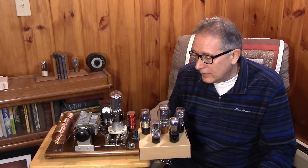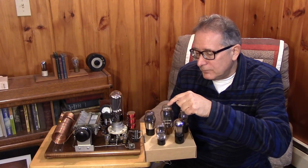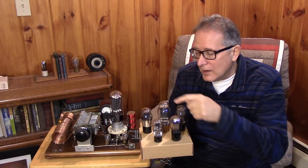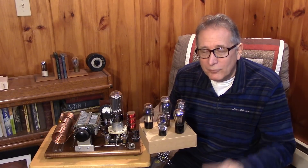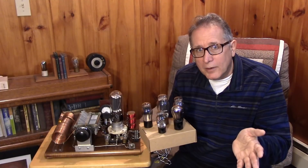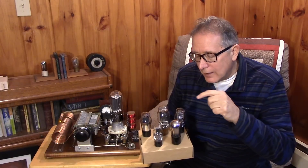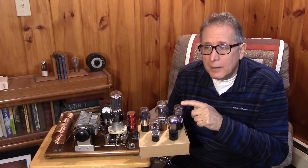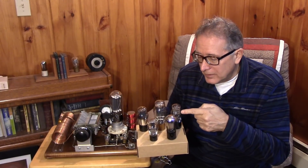With these smaller tubes, you should be able to achieve something between half a watt and probably four or five watts output. The efficiency of an oscillator is generally around 30 to 35 percent. So if you're running this Type 10 triode as an oscillator at 10 watts input, you might get three or four watts out. Getting a single tube to oscillate on 20 meters in a stable fashion is a little bit tough, so a lot of people on 40 and 20 do use master oscillator power amplifiers — MOPAs — perhaps with a Type 27 oscillator driving a Type 45 final. The 45, by the way, is a 1920s tube, very popular in jukeboxes in the 40s and 50s, and still being manufactured because the audio people love it.